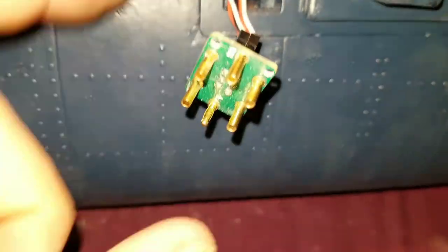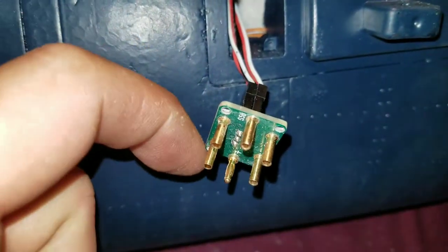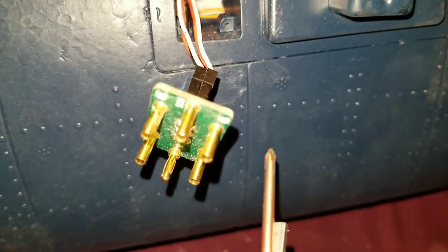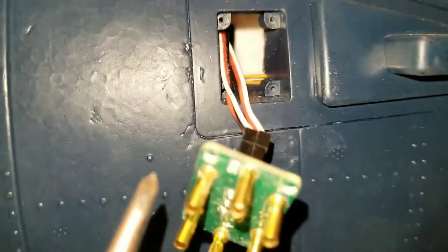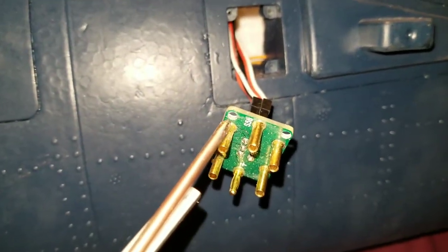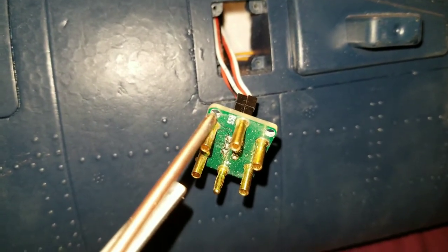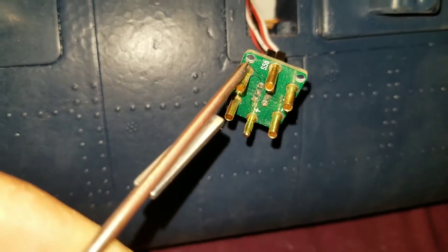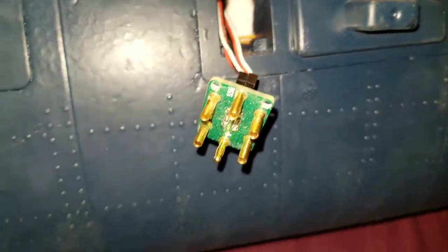Pull this board out. We took a sanding board and sanded the edges all the way around this PCB board to loosen the fit. We also rounded the corners. In addition, I reamed out these holes so that the screws fit in here a lot looser than they originally do. You can drill them out one size up and make it so there's a loose fit.